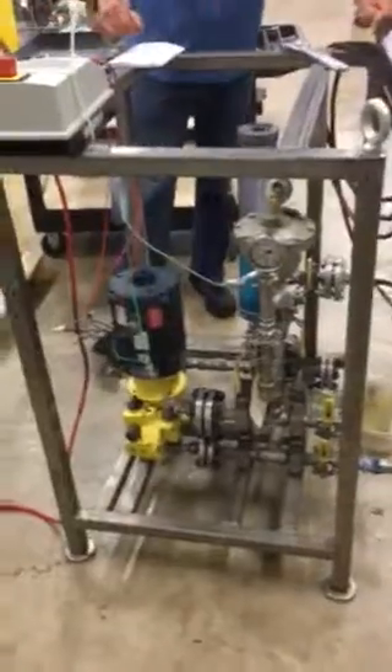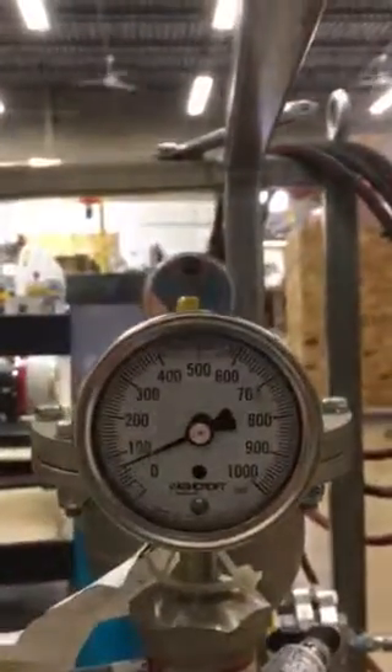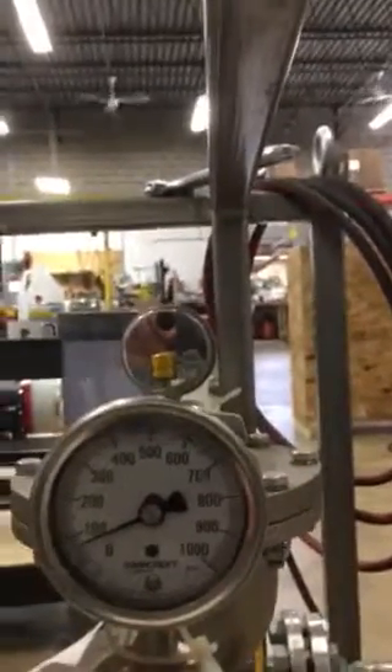So let's go live. We've hit the go button. We can see that the pressure is slowly climbing. We're approaching the 80 PSI right now. We've reached it and now we're still filling — we're still pumping because we're filling the pulsation dampener. We can see the hertz.